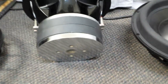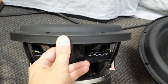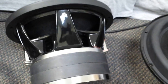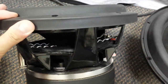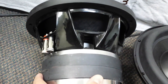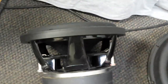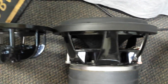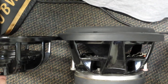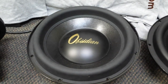Our 10-inch Version 3 uses the same motor as our 12 and 15-inch drivers, along with a very high roll surround similar to our Obsidian 15, a large dust cap, and a different basket along with a different cone, spider, sewn down leads. This driver will be rated at 600 watts RMS, just like the rest of our drivers, with large terminals. You can see that this basket is significantly deeper than the 12-spoke, which allows for higher peak-to-peak excursion.